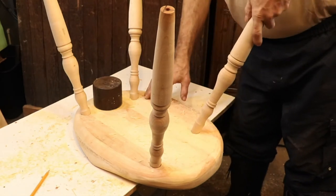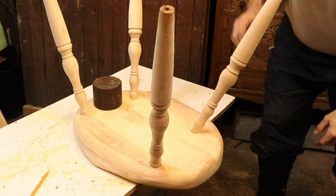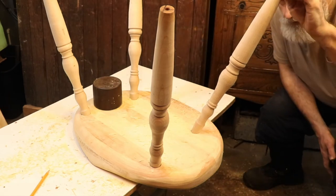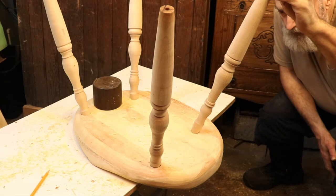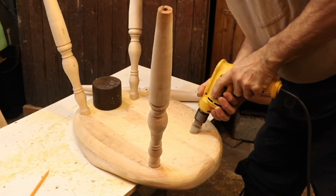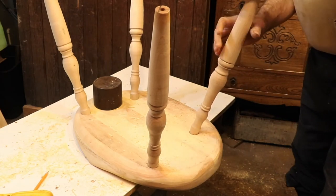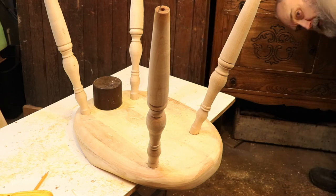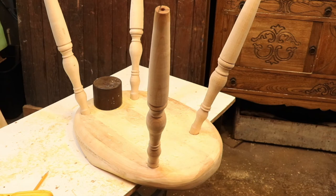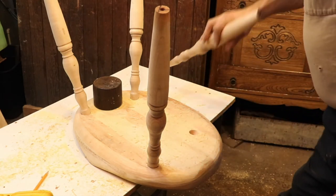At this point I can lock all four legs into the seat and I can start lining up each set of legs to see how they fit. It's really obvious that one of the angles on this leg is really off and I haven't quite figured out how that happened. The other three legs are very close — they're just going to need minor adjustments to bring them in line, but this one's way off in left field. So I'm going to push the reamer as far as I can to try to correct that hole, but there's a limit to how far I can go because if I go too far I'm going to wind up with an oval socket at the top and that's going to make the leg totally useless. So I'm just going to have to correct it as much as I can and live with it.